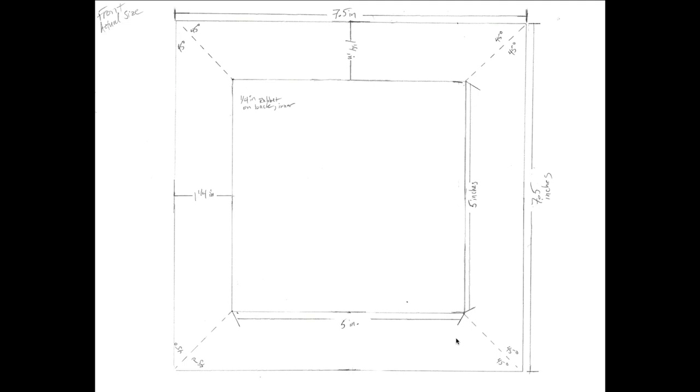And this is the black walnut that I've got milled up and ready to be cut, and that my neighbor's going to help me cut with a bit more precision on his table saw. On the inside, which would be the front side that you're looking at here in the plan, I'll get my little trim router out, put a rabbet bit in it, and cut a 1/4 inch, maybe 3/8 inch rabbet.